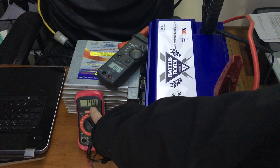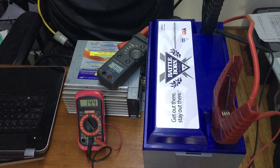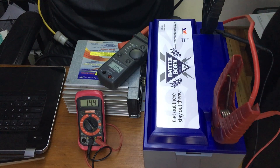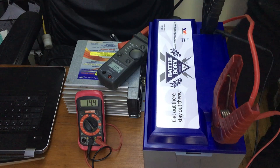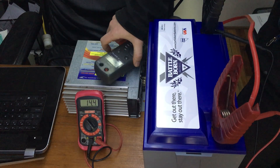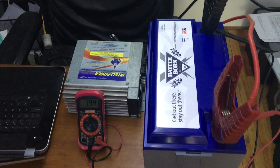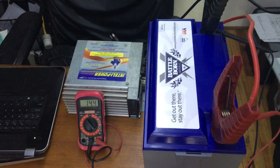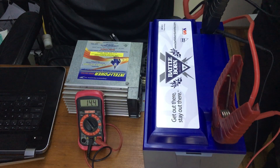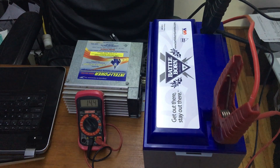So that's what we're testing now — we know it's full and we want to watch how far and how fast the voltage goes down with no power coming in. I'm going to pull this out — we should see that drop. I'll calibrate my Fluke to check if anything is back-flowing. We're at zero — nothing's coming in, nothing's going out. The battery is at 14.4V.